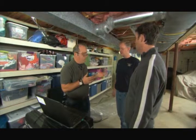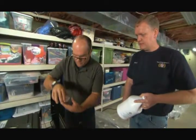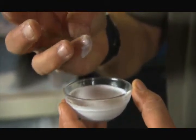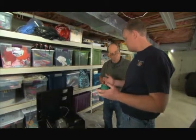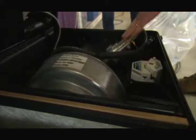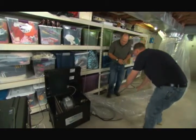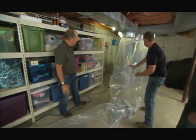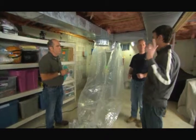So how do you seal the ducts? We start with this sealant — it's a liquid, sort of milky and rubbery. In order to seal the ducts, we need to atomize it as an aerosol. We use the same fan as the pre-test, and a nozzle injects the liquid into the duct. The small particles in aerosol travel through this flexible duct to a Y-branch, and then it can go to both the return and the supply — so we seal both at the same time.